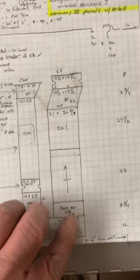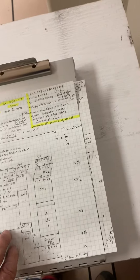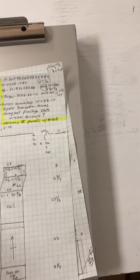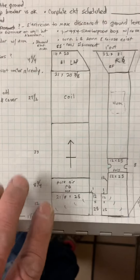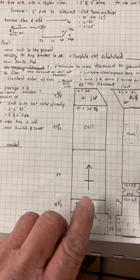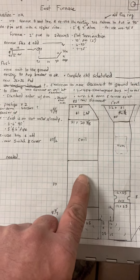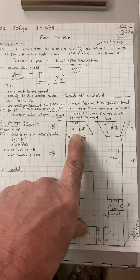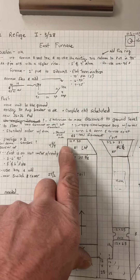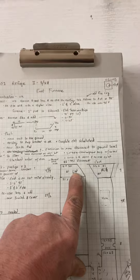On the east furnace, that's where I'm at. So the furnace will sit on the 90. I'm going to have a pure air filter box, and the furnace will sit on the pure air filter box coil. I just made a little transition, and I'm going to make it a lap fitting. Your cut line is going to be right there.